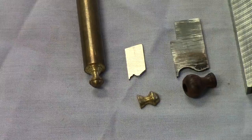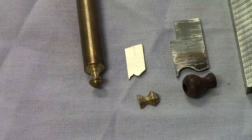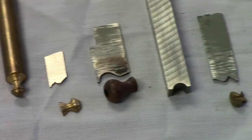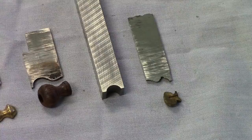It was profiled in plastic, and then this one was actually done in brass, and I cut it in half to cut away and sculpt the cutter. Now these profile cutters are mounted in your tool holder on your metal lathe, whether you've got an Aloris or a tool post, whatever, and typically I will set them just a fraction below the center line.